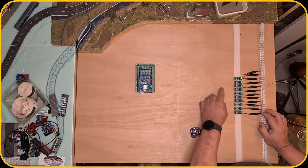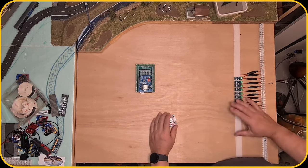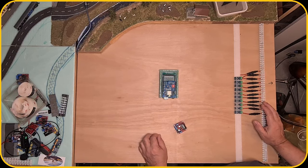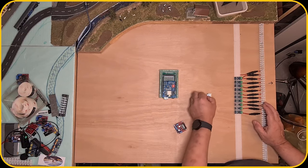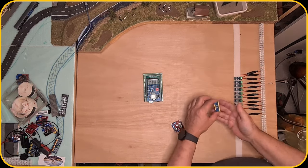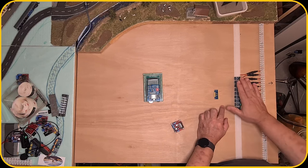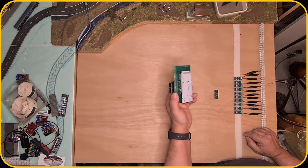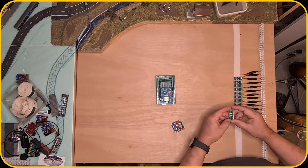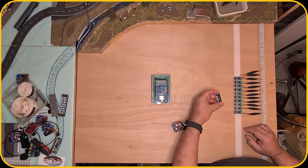These current sensors, they have an analog output. The problem is I have 30 current sensors going to be positioned over here. The Arduino Mega only has 16 analog inputs, so we need to resolve that. And the way to resolve that is using a multiplexer. So this is a multiplexer, and this multiplexer has 16 outputs. So I can use 16 outputs, go to one pin, and then only have one analog pin on the Arduino. But with that, because I'm using 16, I need to have four control pins. So four control pins here need to be for controlling these 16 pins.